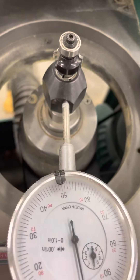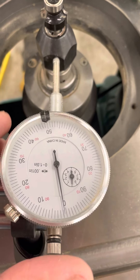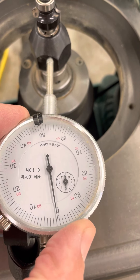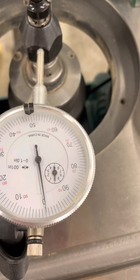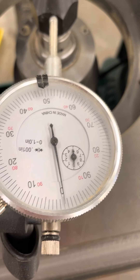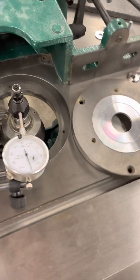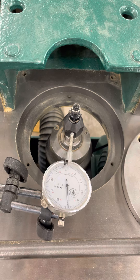I'll unlock it so you can see — it's unlocked right now. So I'm going to lock it. This is just a cheap dial indicator from Harbor Freight that I use for things like this. That's zero. If I tighten this down, you'll see my deflection is less than a quarter of a thousandth now — from ten thousandths down to a quarter. So I don't have the issue with the bit changing position on me.